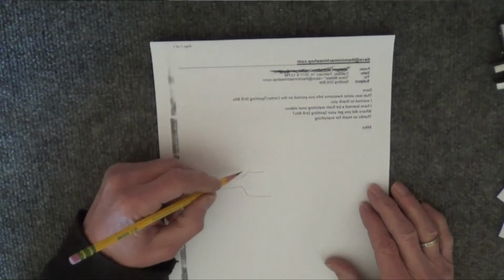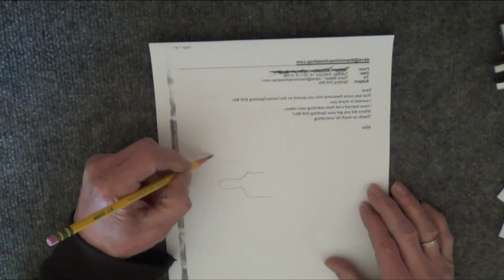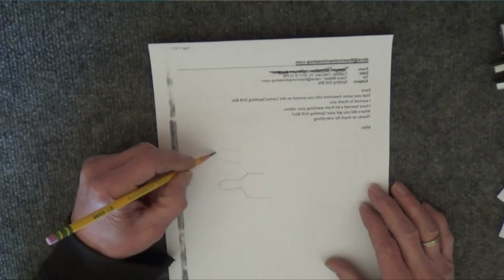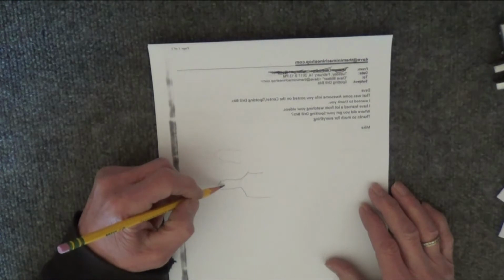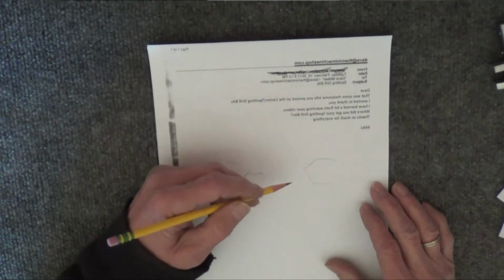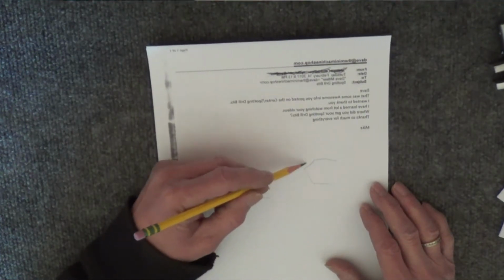And this angle matches your live center or dead center. And this whole part here, make sure you have a pocket so that you don't bottom out. So the center drills are specifically designed for your live center. Spotting drills are like that, and this angle is 1 or 2 degrees off from a drill bit.